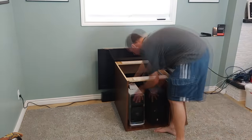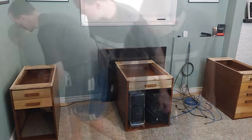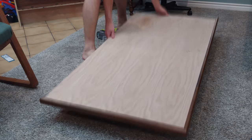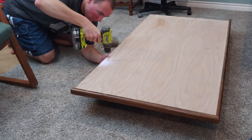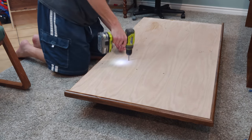Now that the lift and TV were mounted to my wall studs, I can begin placing the desk cabinets in their correct locations and reinstalling the drawers. I then lay the monitor shelf face down and rest the tabletop upside down on it. I make sure to drive in the 2 rear screws before the rest to ensure proper alignment of the rest of the holes, as a screw coming through my nice new tabletop would not be good.